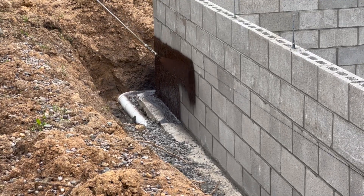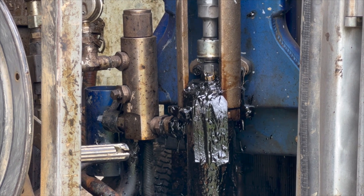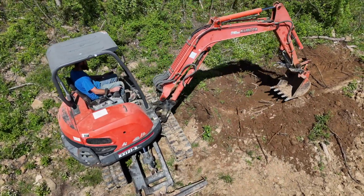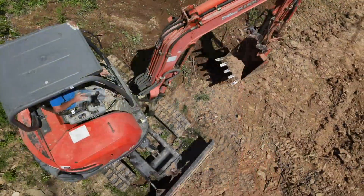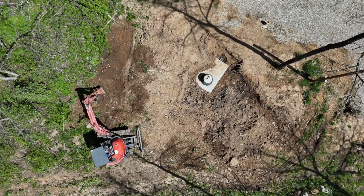People mentioned that when the tank was uncovered, we could put a waterproof basement-type membrane all around it. That thought did occur to me — it also crossed my mind when I thought we were losing water. For now everything seems okay, but waterproofing would have been the next step if we still had issues. Another suggestion was to dig a trench around the tank, fill it with corrugated pipe with holes in it, and backfill with stone to direct water around the tank and down the hill — we considered that too.